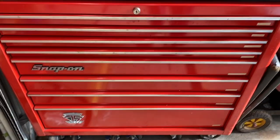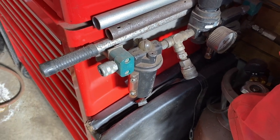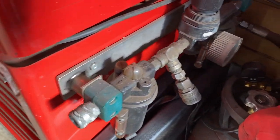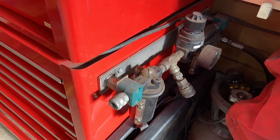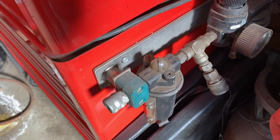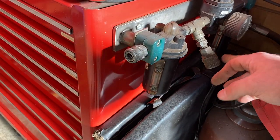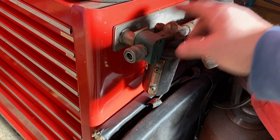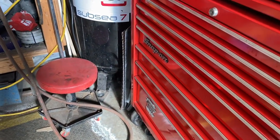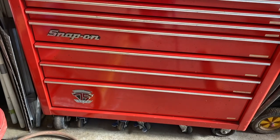So that's my box — that's the one I've had for a long time. I made a little bracket on the side. I made up a bracket with stauff clamps to hold my air regulator. It's got a water separator at the back. Then the T-piece comes off after the regulator, then to the lubricator, and then out. So if you don't want to use the lubricator, you plug it in here; if you want to use the lubricator, plug it in here. And then you can actually adjust the regulator up there — so that's my toolbox.